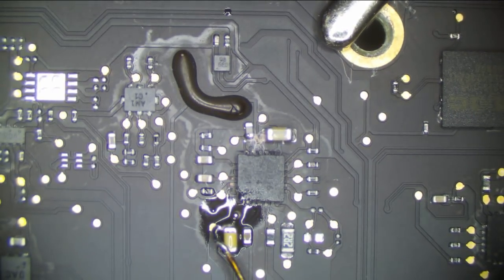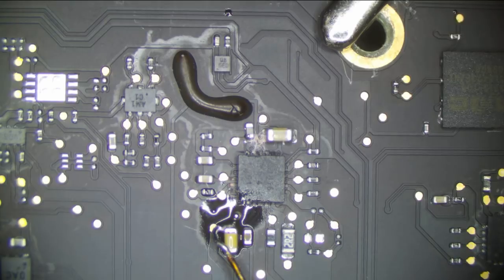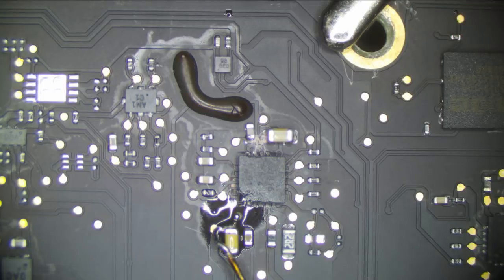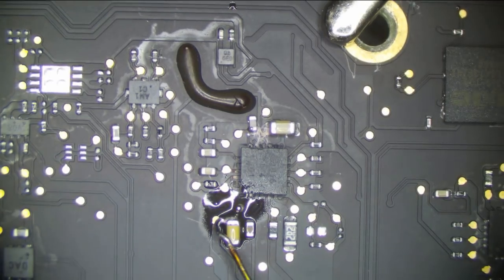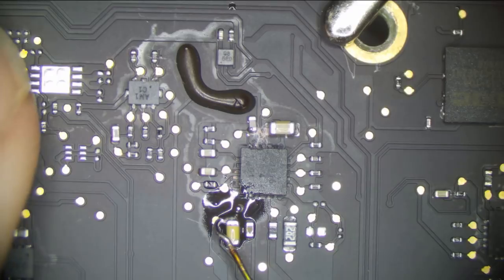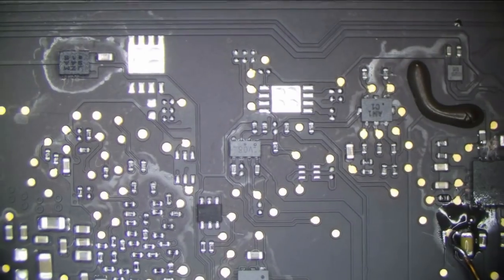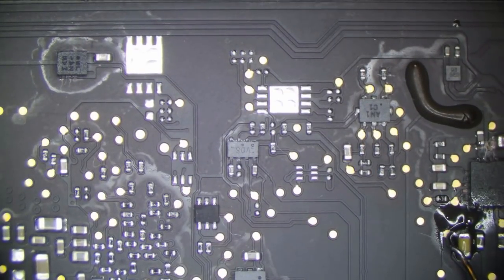So we're going to go to 2 volts. 4 volts. Oh, this is going to suck to find. Whoa, shoot, went a little bit too high at 6 volts, but it should be okay. That's still in tolerance, hopefully. And with the wonderful help of FLIR infrared, hopefully we will find this short. Something's getting to 160, 170 degrees over here. Let's see where this is at. Let's see what's getting to be 170 degrees. 170 degrees on a MacBook motherboard. Imagine that. 159.